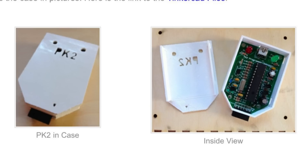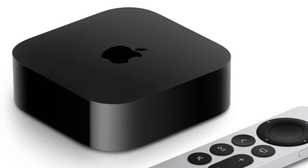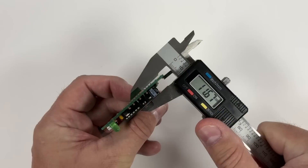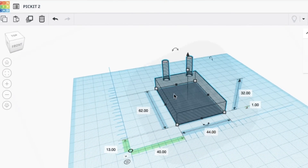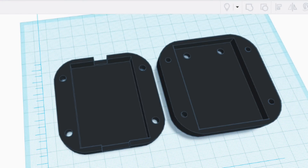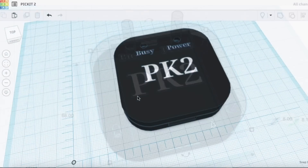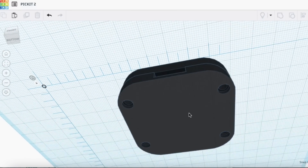Years ago I made a really ugly 3D printed case for my PICkit-2, so I want to make a new one. I have this logic analyzer and I like the looks of its box, and I've always liked the look of the Apple TV box — so I wanted to do that with my design. I took my assembled PICkit-2 clone, measured its width, length, and height, noted the two LEDs poking up, and modeled a box. I made a whole box, took away material, created the shape I wanted the case to look like, grouped it together — so there was space for the PICkit-2 programmer, holes for the LEDs, and when assembled it would look just like the design. I put lettering on it and I added holes for screws in the bottom so I could screw it together.